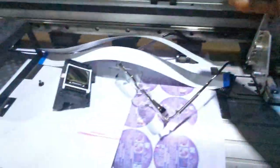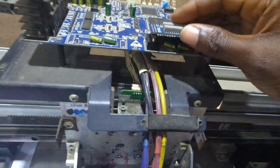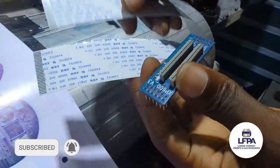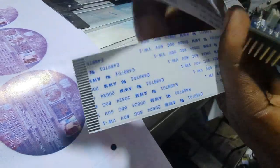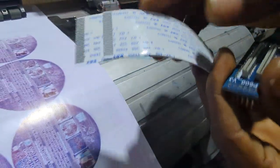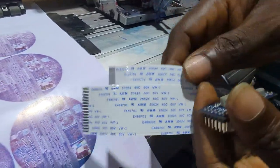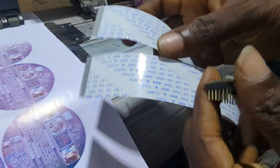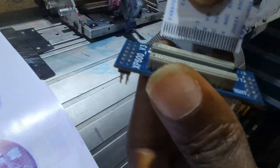If you look at these pins you can see how this lines up. Your cables will come with a tiny notch at the sides. The side with the notch is not the side that goes into the chip — the side without the notch is the one that goes in. It doesn't matter which cable you use for left or right; just make sure you put one on the left and one on the right.